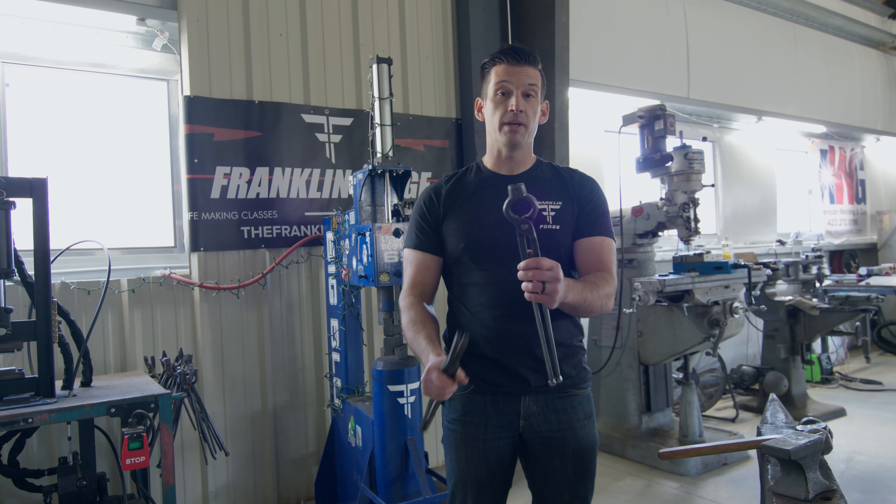The last piece of equipment is your heat source. For blacksmithing or knife making, you need some sort of forge. With a propane forge, you can build or buy your own — pricing ranges from about a hundred dollars all the way up to almost two thousand. I built my own for relatively cheap. A propane forge is great especially for knife making because it's easy to control your heat and temperatures. You want to be able to adjust that regulator so you can properly heat treat your blades. To simplify it, the four things you need are an anvil, a hammer, some tongs, and a forge. That's all you need to get started — you don't need a power hammer, press, or any other fancy equipment.